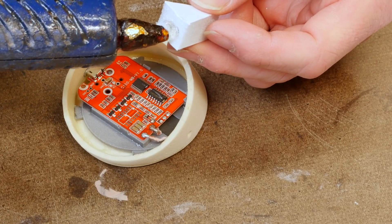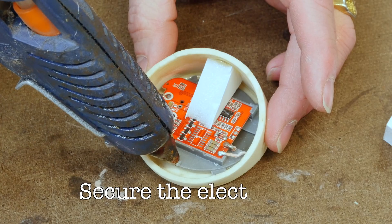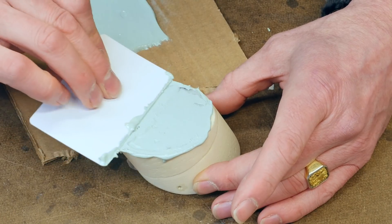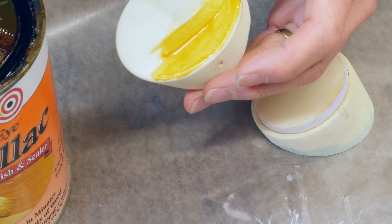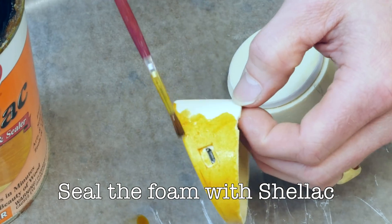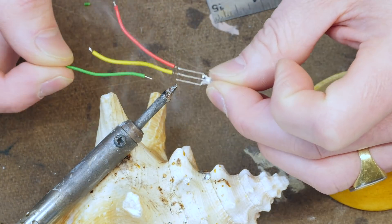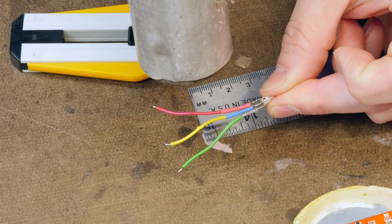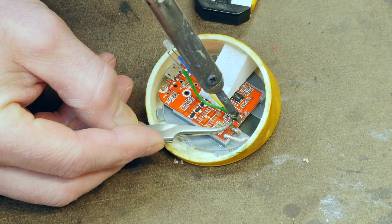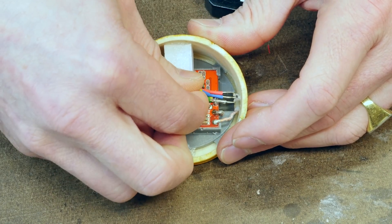I'm also drilling in the hole for the LED using a Dremel, which gives me a little more control than a drill bit. I drop in a little piece of half-inch foam left over from the spray booth build and hot glue it in — it's easy and appropriate, and I can cut that piece out if I need to. For the bottom where all the BBs were, we just lay down a coat of polyester resin — some polyester body filler. Next, we paint the foam or seal it with some shellac; this builds up a little layer and means we need less primer later on. I solder some wires onto the LED so I can solder it back onto the board, giving us some flexibility and making it a lot easier to insert the part and make it functional. The LED fits into the hole and we are all set.